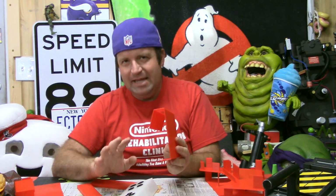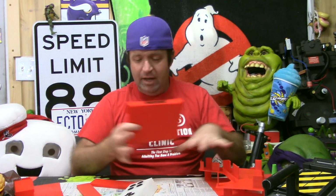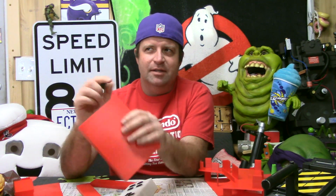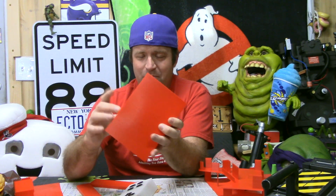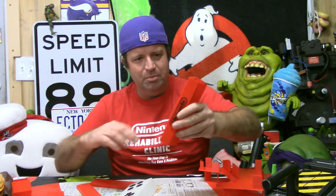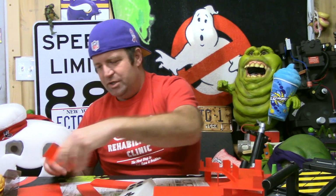Now, I had some problems printing this, and I think it was due to a problem with my printer, not the whole thing, but just the lid, because this was the last piece that I printed. It turns out I ended up getting a clog, the notorious separation of the Bowden tube from the hot end extruder. I think the beginning of that problem was when I was printing this, because I got several lines in it, and I printed this twice before I got it semi-usable. You can still see there's a lot of lines in here, but I think it was due to under extrusion.